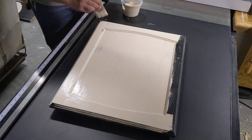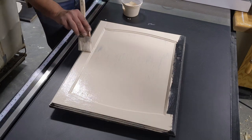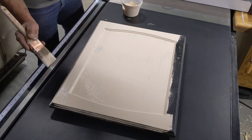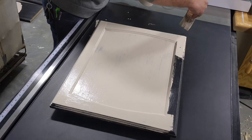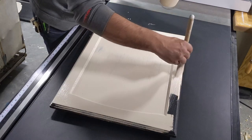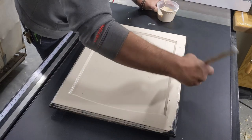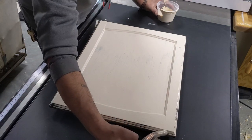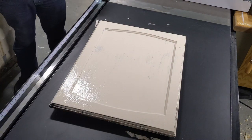Here I'm at the end and I have two options. I can either do this, which ends up creating a bead that I have to wipe off, or I can feather in that way — just let that brush drop while it's moving and not leave a mark. Either way, whatever works for you. On this side, same kind of approach: start there, let that just feather itself out like that and match that joint. I'm coming back through to feather it out. If I come in that way it often creates a drip, but you can drop down onto it and eliminate it.